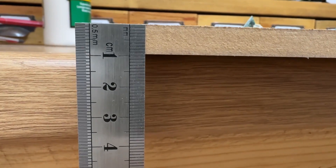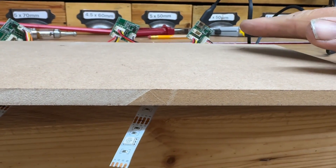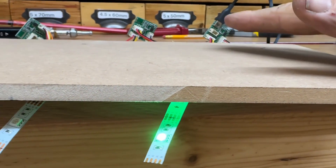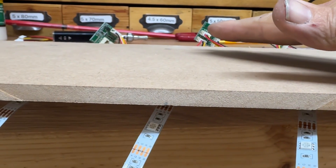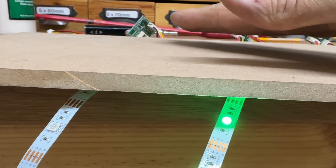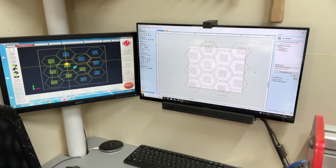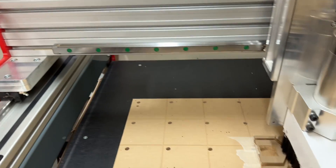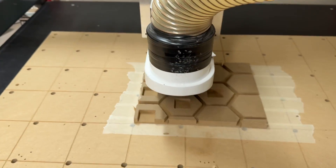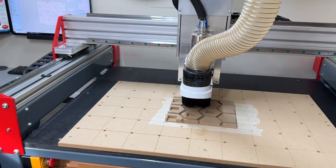In this next clip you can see we've got 9mm MDF and I'm still hovering my hand over the wood without even touching it. My assumption was that I could probably go to 20 millimeters and still have a trigger on the proximity sensor. Just to confirm this, I made a test piece out of MDF the same thickness as the oak I'd be using.